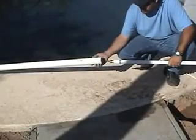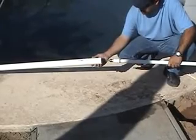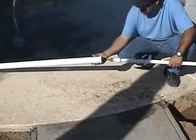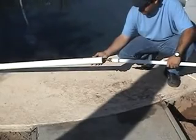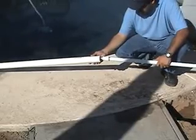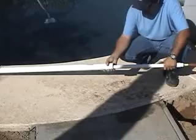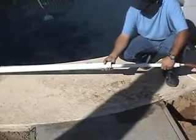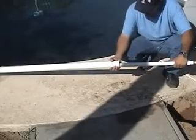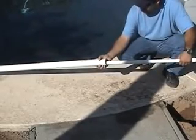Okay, some people use a sleeve over the water wand to help control the erosion under the deck, or to ensure a sufficiently wide tunnel. If you do, cut a length of wider PVC of sufficient length for the job. What we have here is 2 inches for the sleeve. All you have to do is insert the water wand inside till the nozzle sticks out on the other end a little bit, and then feed them both up under the deck at the same time.